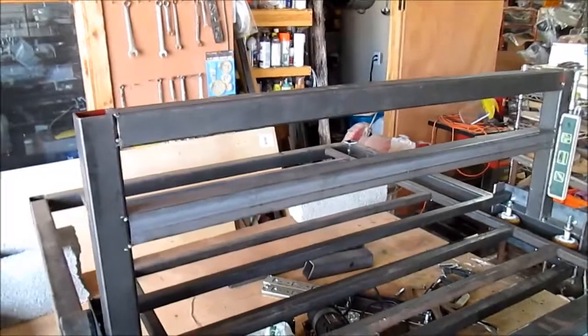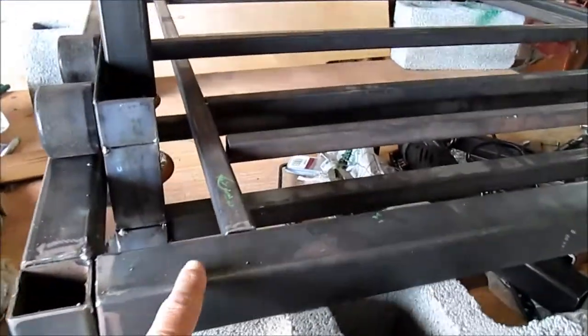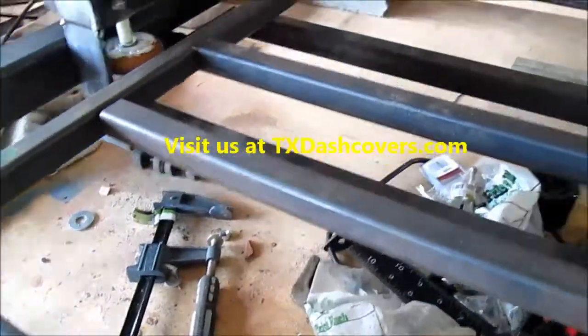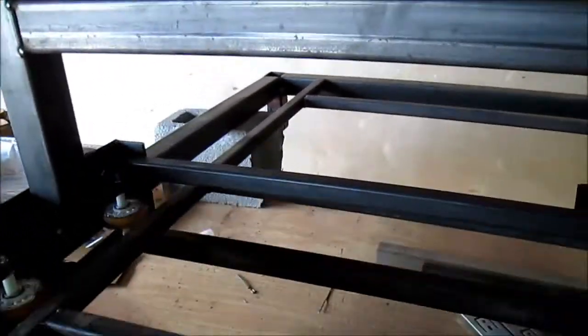This machine here is a 48 by 48 inch table — of course it's not going to cut that much. I used 2x2 square tubing all the way around. I used 1 inch in the centers and I've still got everything just spot welded. Then I used an inch and a quarter down here in this area on the bottom of the sliding part of it. It seems to roll very freely and very easily.